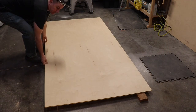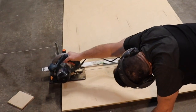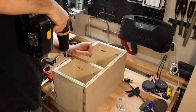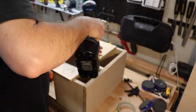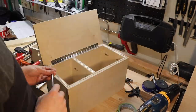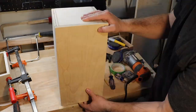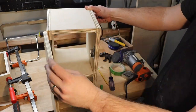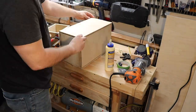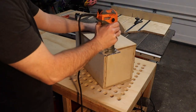Here I'm cutting half inch plywood for the front hinge door and the back. No scraps left big enough for this, so I had to cut into a new sheet. Using a 12 inch piano hinge for the door, I lined it up and attached it after pre-drilling. Then I attached a magnet to keep the door closed, and attached the back plywood with glue and brad nails. I cut the back and front pieces a little big, so I popped in a flush trim router bit to make them perfect.